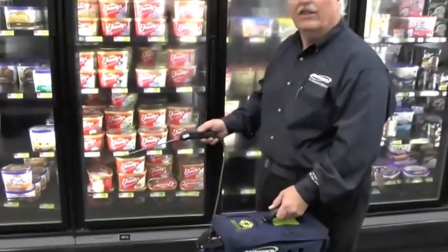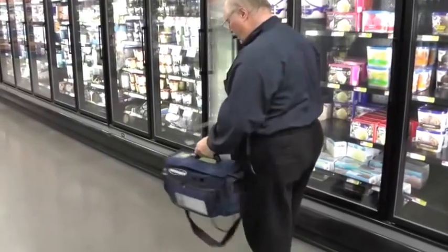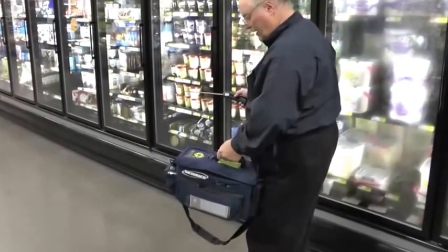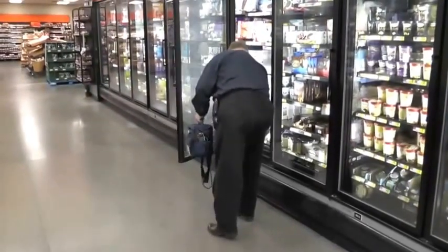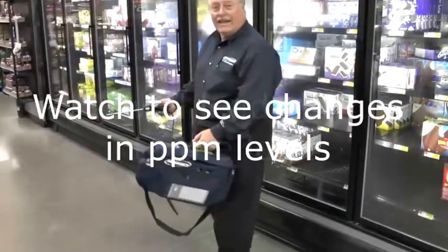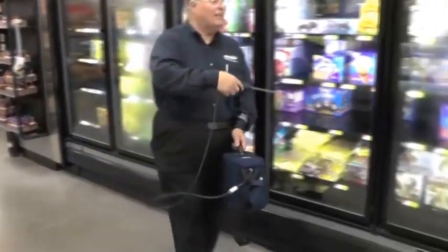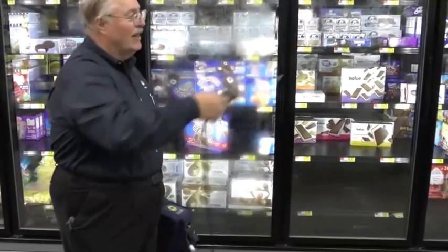That value is a little tiny bit lower. That's about the same. Now I'm up to 390. I'm getting a little bit higher — I'm at 478. Now I'm down to 378. So the leak is going to be in this area right here. This is where my highest value was as my readings increased from one end to the other.